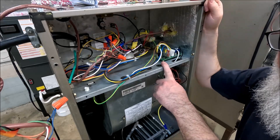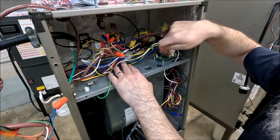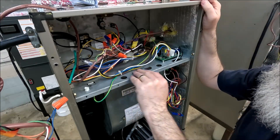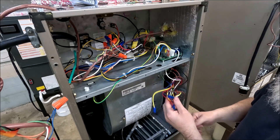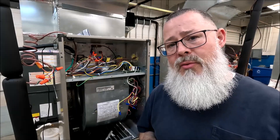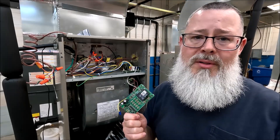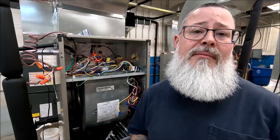I chose not to use 24-volt straight wire on the R terminal, and I'm not worried about setting the test pins for timing in this case. This thing is pretty self-explanatory — it's going to save you from hacking up wires. It comes with a sheet of instructions in the box. If you're looking to go back to an older-style PSC motor, which is a bit more reliable and doesn't have some of the issues the X13 does, you might want to consider this board. It's been out for a while — check your local parts house, Amazon, eBay, supplyhouse.com — Google it and somebody's got it somewhere.